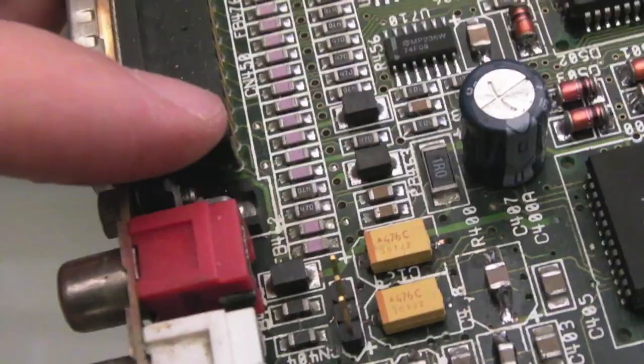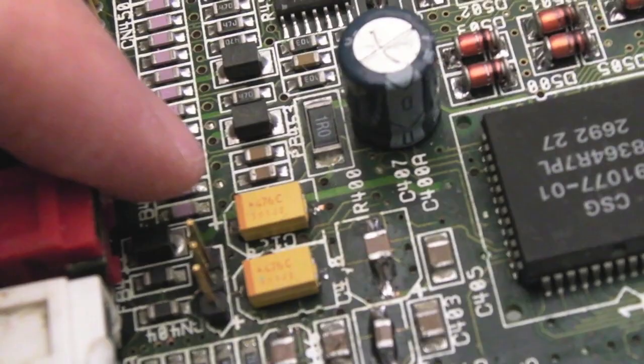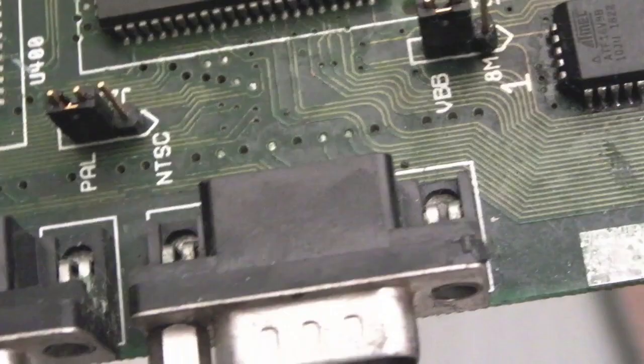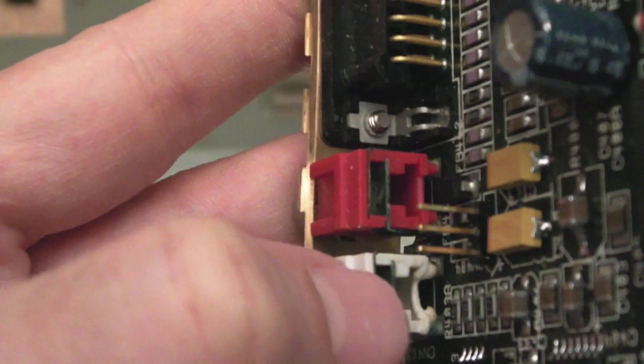You can see the SMD caps have been replaced with other SMD caps. They were originally SMD electrolytics, but they've used ceramics or something there. Those kind of look like tantalums, actually. You've got one here, look. One down here with a crazy bit of solder strewn to it via, so presumably there's a bad connection there. Lots of horrible looking wires and things around there. But I do think it's working. I don't think there's a problem there. Having said that, there might be, because I think he was having a problem with the mouse or something. I think one of the ports here is not working, and you can see someone's previously melted that there. So we're going to swap those out anyway.